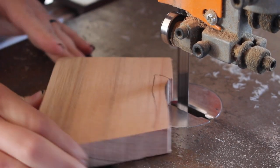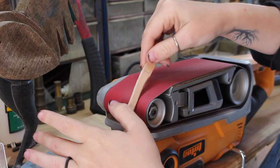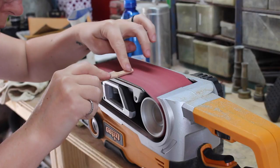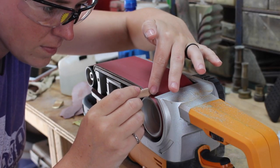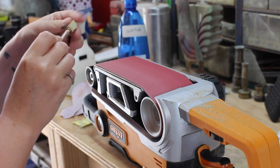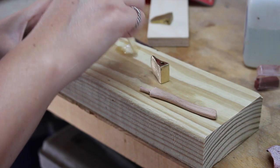Okay the head is done. I moved on to making a handle — just traced out a little handle I thought was to scale and cut it out with the bandsaw. Then once again used my belt sander to shape it to my liking. I shaped the body how I liked it and then moved on to making the eye, using the back of the sander where the paper is suspended in order to make a nice clean shoulder. Then to attach it I used some two-part epoxy.